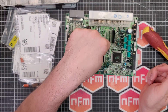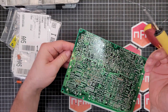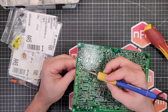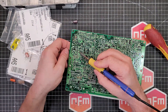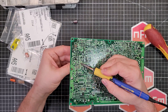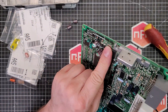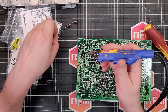So we've got all the capacitors - now it's a matter of getting them all in. Let's do the 10 volt 100 microfarad ones first. I'm going to grab some solder and get these old caps out. Looks like there's no leakage on those ones at least, so things might not be too bad.